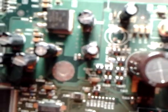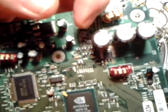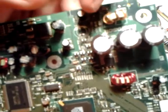The general area of this, this would be the front part of the board, right by the clock capacitor. You'll have three big capacitors right here. Then you would have a mid-size capacitor there, where the white rings are now. That's your clock capacitor. There's plenty of videos out there. Luke Morris has one. It's really easy to follow, a tutorial on how to get it out.